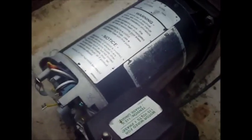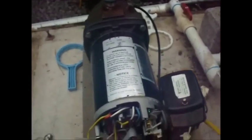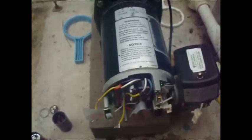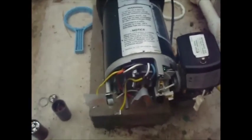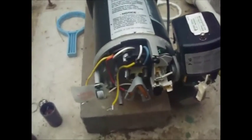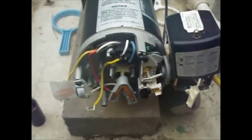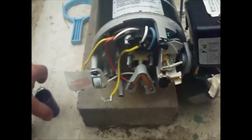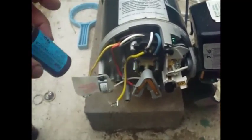It's 5S, it looks like. This pump is probably 6, 7 years old. It wouldn't turn on the other day, so I got to looking and figured out the starting capacitor is bad.